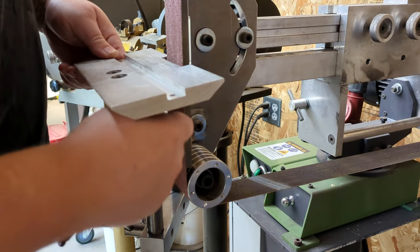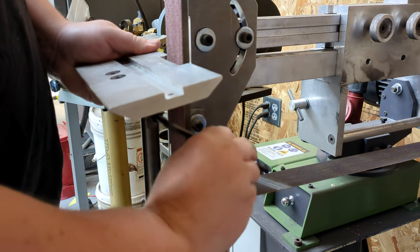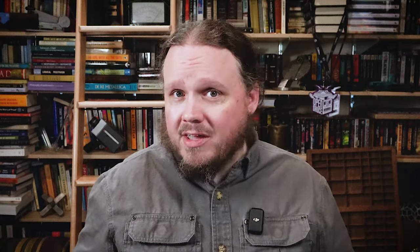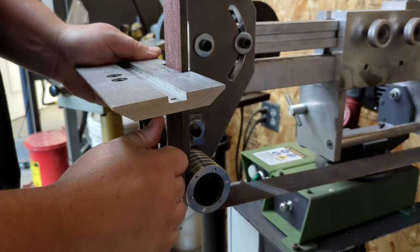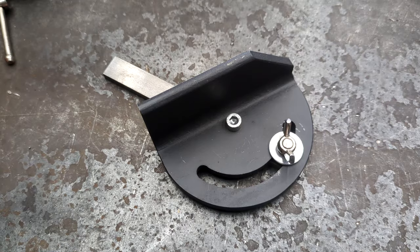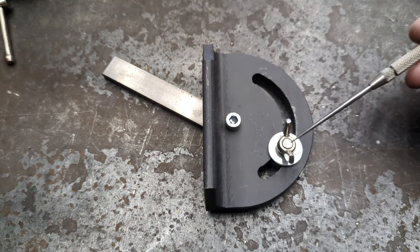Finally, I had to cut the big 30-degree bevels on either side. This meant nodding the mill's head down and milling away a lot of material, and then re-tramming the mill once done. The new work rest worked great mounted back on the belt grinder. I did have another complaint about the design though: to adjust the angle of the work rest, you need to loosen this screw, which releases a clamp on the vertical shaft. The problem is, this screw is also the axle — it's what the work rest pivots about. That means cranking down on it to lock the work rest in place is prone to rotate the work rest, exactly the one thing you don't want when locking it down. That makes getting even a moderately precise angle quite annoying. The better solution would be to separate the pivot from the locking mechanism, like they did on the adjustable tool guide that came with the grinder.